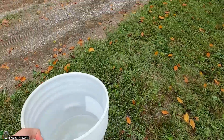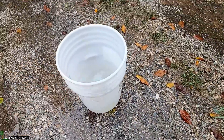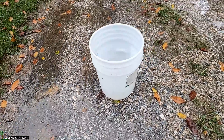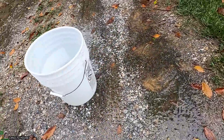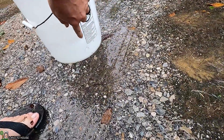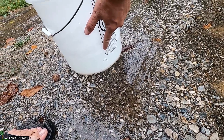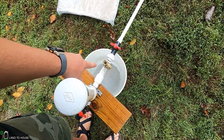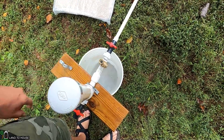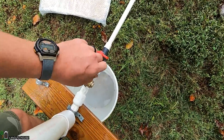I think we'll measure this in the same spot each time. I don't really have a good marker indicator — let's just say it's right here at this line. For the test where the valve is straight up and down, I'm going to time for a minute and a half and then we will measure again to see what kind of water we've consumed.